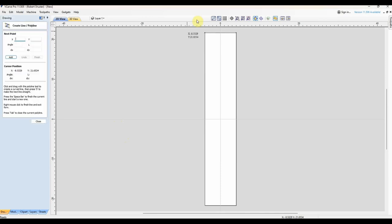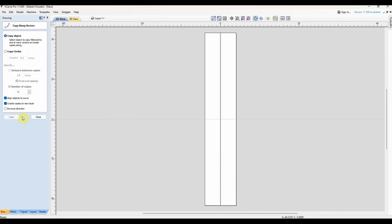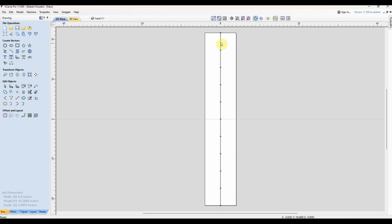I'm going to draw a quick line from top to bottom. We're going to have 10 lugs on this. This system has 4 holes per lug, so 4 times 10 — that's 40 holes technically. But it's hard to start in the middle and know exactly where to have 10 go through. So I'm going to do 11 holes, where the very top one and the very bottom one are the same hole — they overlap each other. So even though I'm going to say 11, I'm actually doing 10. The number of copies of a quarter-inch hole is going to be 11.